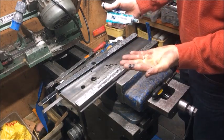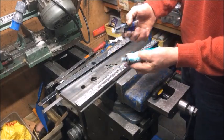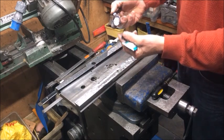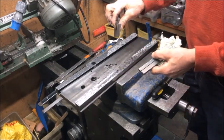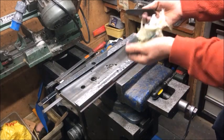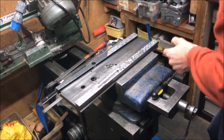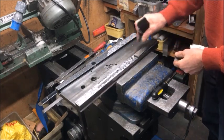Regarding marking compound alternatives to the water-soluble Canode — which is better from a cleaning perspective — you have the Diamant (diamond) compound, and also something called an oil-based water-soluble marking compound from Ariston; I'm not sure exactly how the chemistry works. The deburring stone can be either a diamond stone or the usual triangular shape that gets into the corners. The important thing is that it has to be really flat — both the diamond and triangular types are okay.